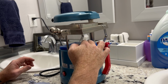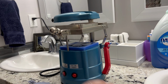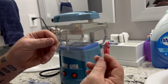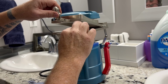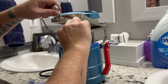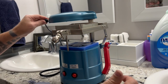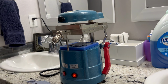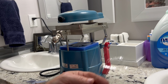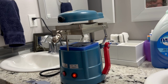We'll put our front windshield in and our other wing window in there so we can get them in. And we'll put another sheet of styrene in by simply lifting that up, putting it across, making sure it touches on all the corners in there, locking it in place, pull the heat around, turn the heat on, and then what you do with the clear is you literally just trim it out with a pair of scissors and it's ready to go into your model.